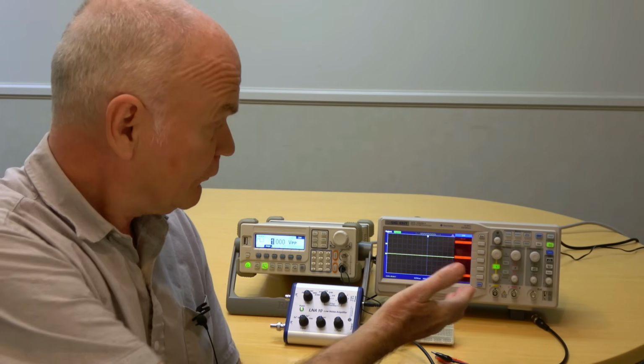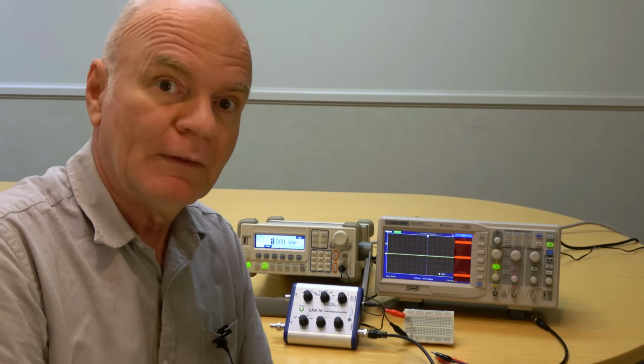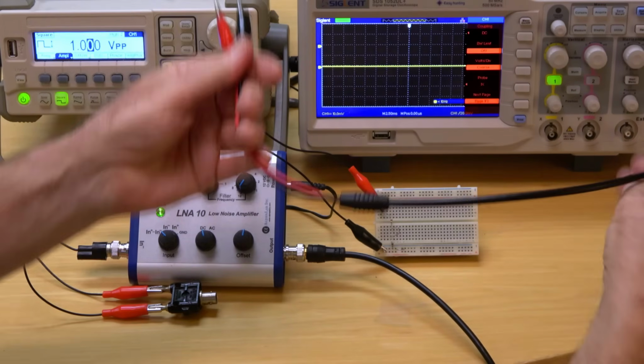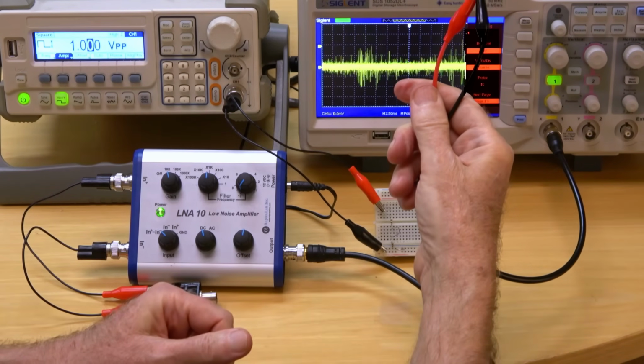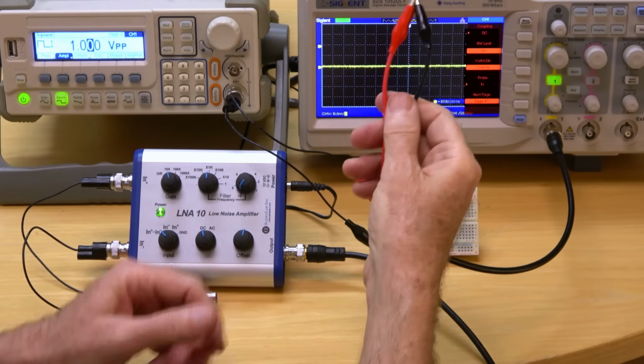If you're using an oscilloscope to analyze weak, low-frequency signals, it's possible to measure down to the microvolt range. First, once you connect a probe, even with a short circuit, the scope is picking up a lot of noise, so you should turn on the bandwidth limit for low-frequency measurements.